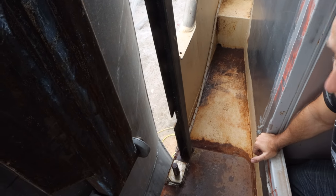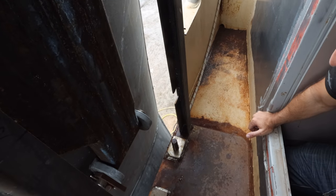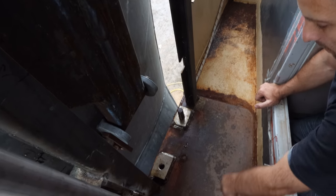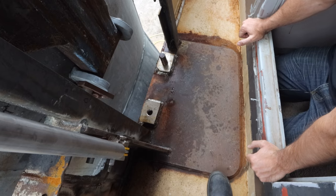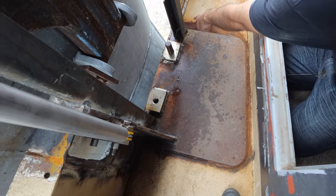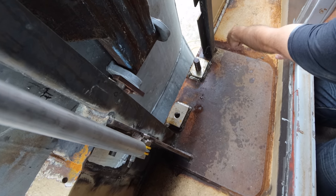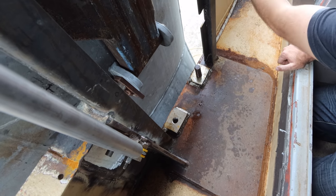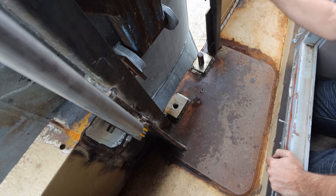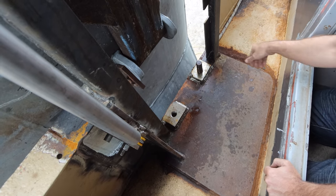And you've got to weld that bottom. Yeah, I've got to weld the bottom around properly in that. So I'll probably get the sandblaster up here soon and give all of this a good blast up so that I can get my last final welds in. You're doing another weld on the doubler, right? I want to do another run around the doubler. I want to blast this and do 3 runs around the outside of this guy, and then I'm going to build in the side. Put it in a vertical, so same as what we've got on this side, but I'm going to do one over here, put in a vertical on that one.